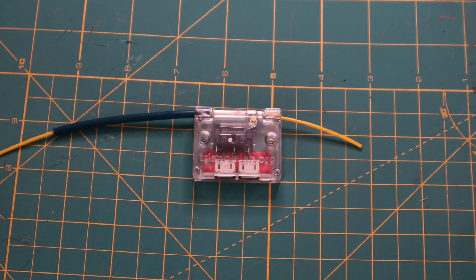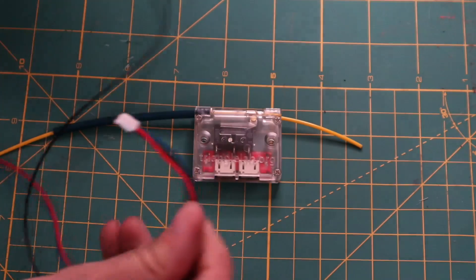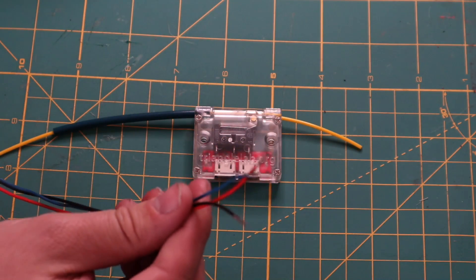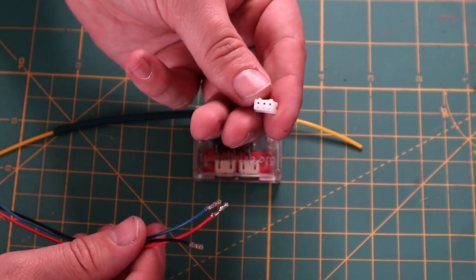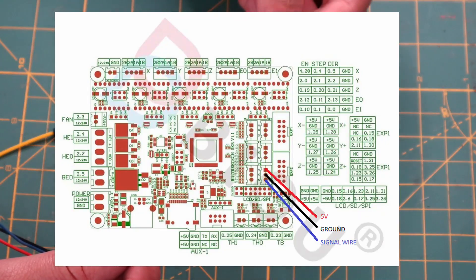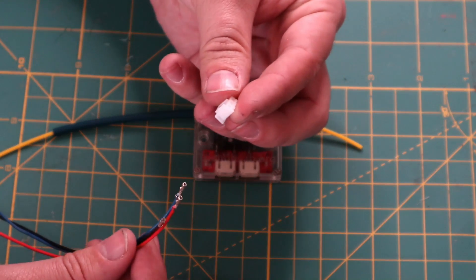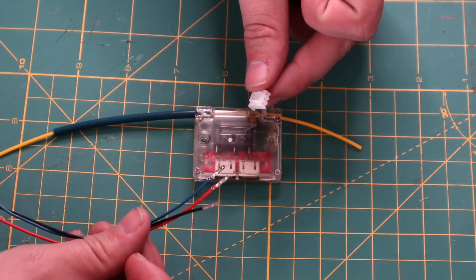As for the cable that this is supplied with, it comes with a cable that's terminated on one end for your runout sensor, and it's got three other ends that are already terminated for a standard connector for your machine. You can go online and find out the exact pin-out layout. I'll attach a photo of the layout on my CR-10S using the SKR 1.3 board, and you can arrange it according to your printer without having to cut and re-solder new cables. That's a nice little perk.